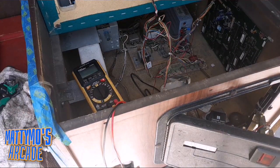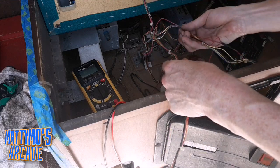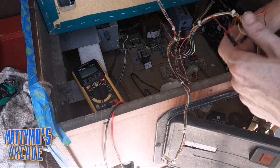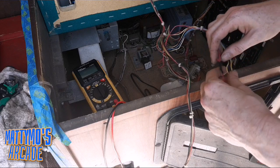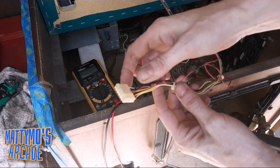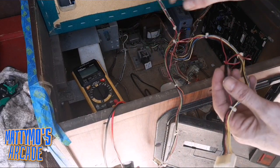Okay, I have that wiring done. I spliced in the wiring. Like I said, I don't really like it like this. I need to zip tie this up and clean this up. I don't know if you can see this. This one wire that I ran straight from the power supply is just out and about. So I just spliced it in here with some solder and heat shrink, and then the 5-volt comes to this, but it also right here daisy chains over to this other connector.